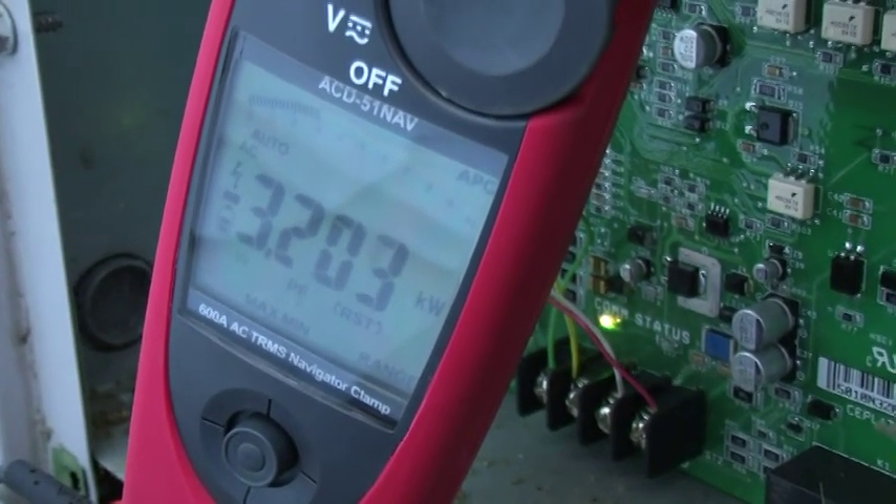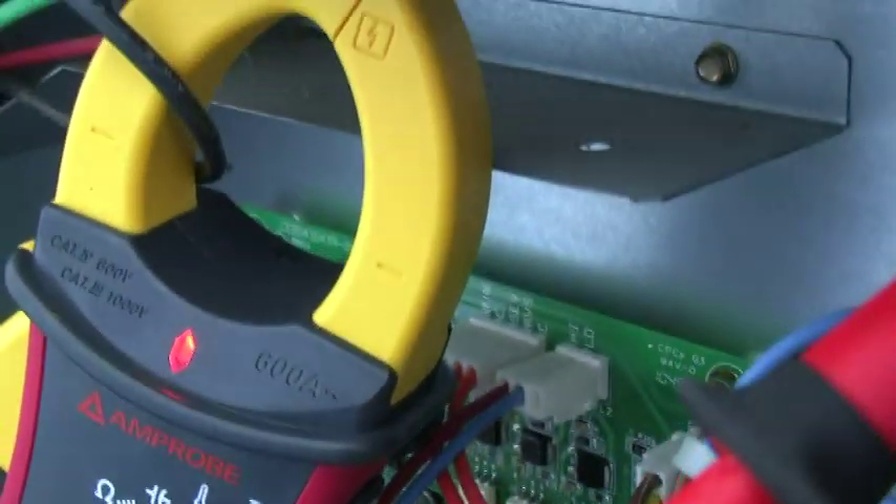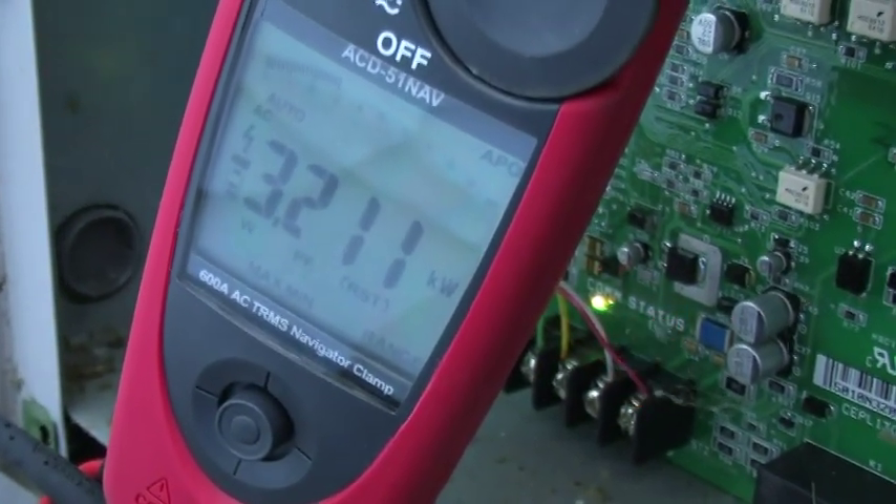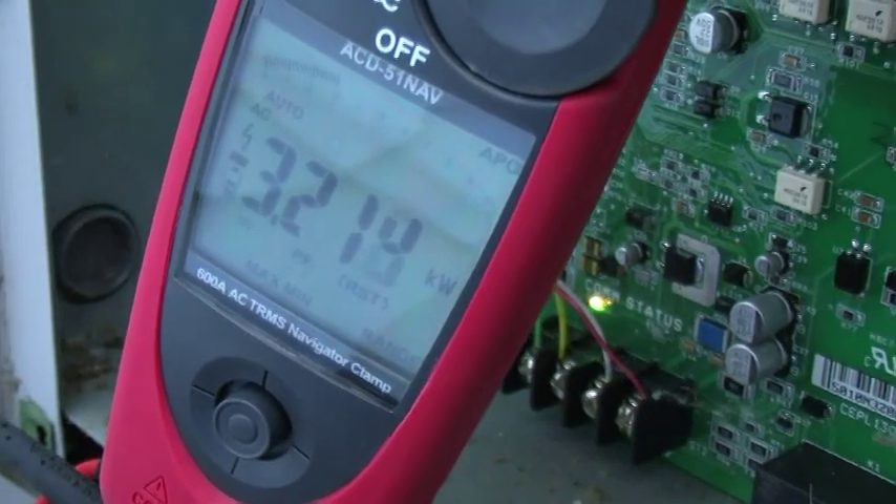Here's the watts — we're at 3200 watts right now. I haven't changed anything; still clamped the same way. But the watts changed — 3200 watts, it's gone up a whole lot. Now what I'm going to do is go downstairs and recheck my airflow, which I know is going to be the same. But I want to get my BTU output — measure temperature, humidity, and wet bulb. Let's go do that and see how it's affected.